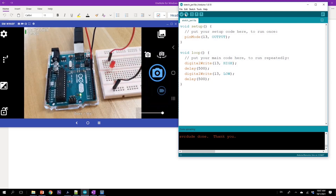So now what we're going to do is transition from sketch to the actual bare metal programming. In order to do that, we must first understand how pin 13 from the sketch library translates to the port and pin at the ATmega328 controller level.